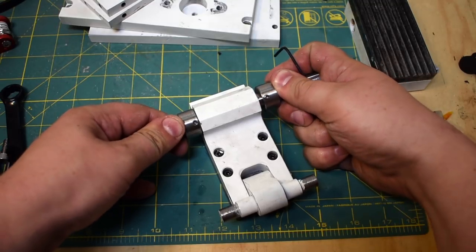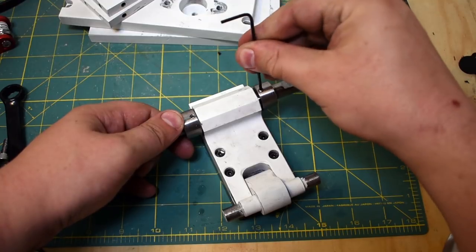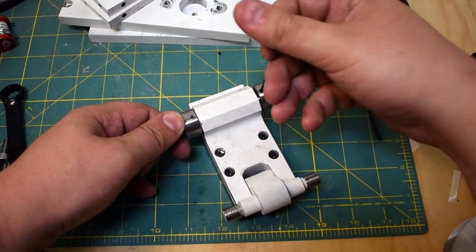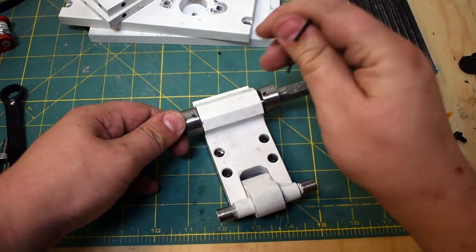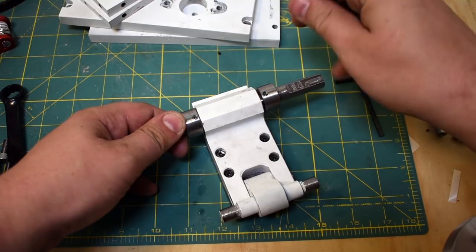I mean, that's just because of the geometry. That wasn't because carbide can't cut case hardening, but... yeah, it turns out I made a pig's ear of that, so now I've got this kind of dimpled set screw thing going on here. I think it would have been a lot better to use a roll pin.